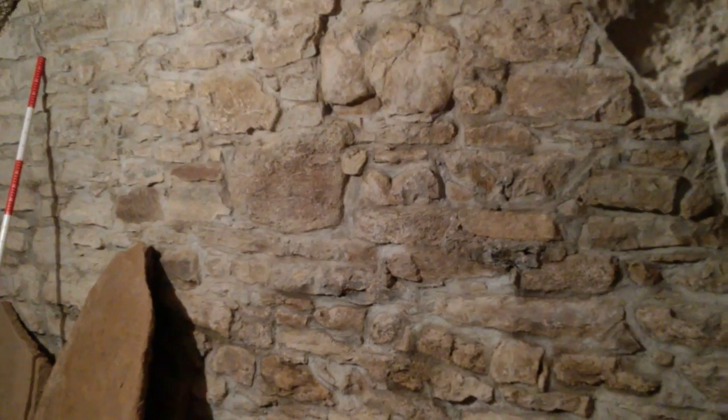The last time I had done the sandblasting, cleaned off the stones fairly okay — although it was a bit of a weak compressor — but they cleaned up okay, and we repointed them with trass cement mortar, which is a bit more of an old-fashioned type mortar. That's dried off quite nicely; the bottom rows are still a bit damp because we only did those a couple of days ago.